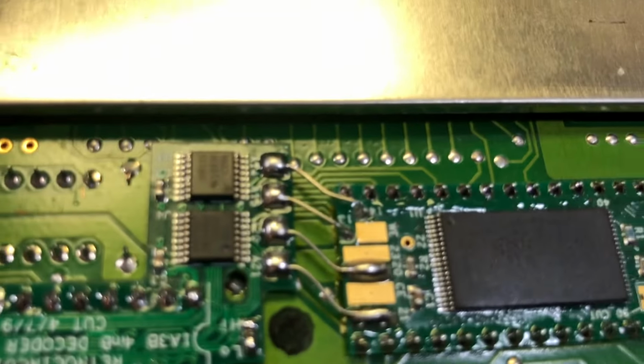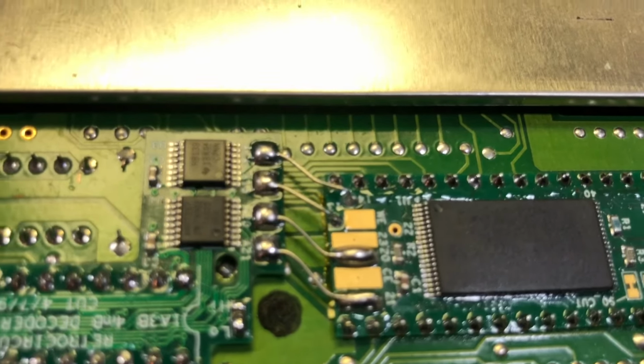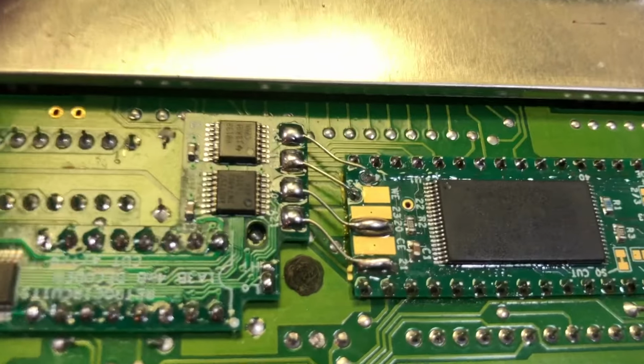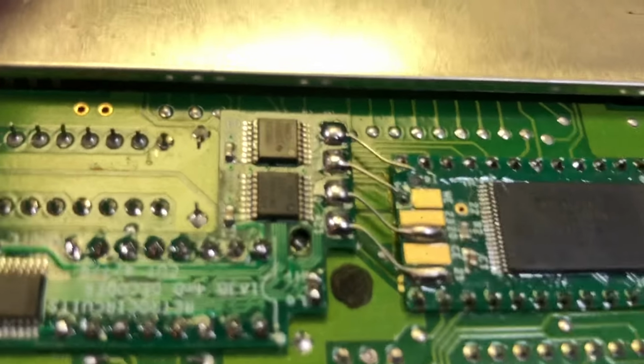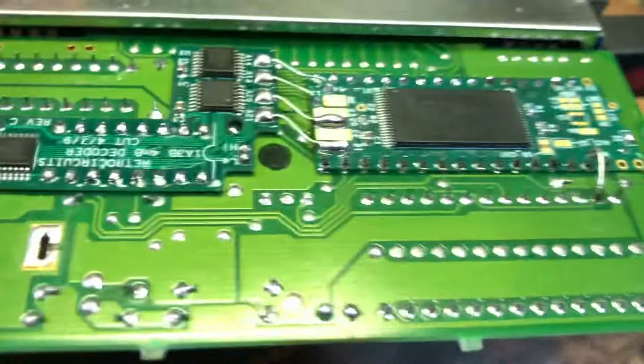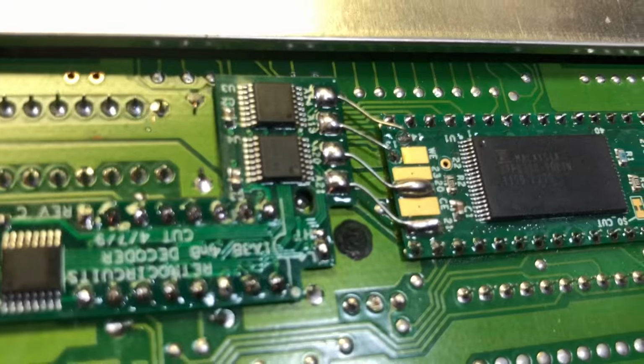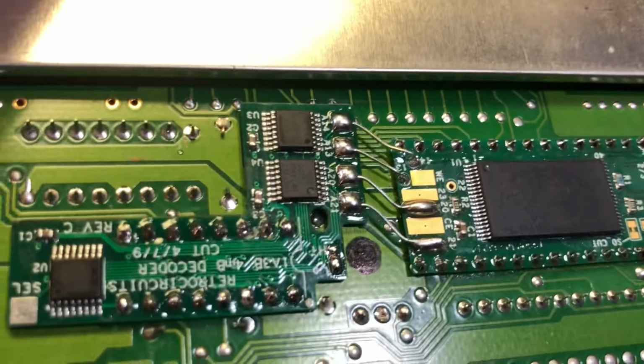So anyways, those lines 13 and 14, those address lines, those are only for high map, by the way. Low map, it doesn't need that at all. So I suppose if you were to just do low map, then you wouldn't need to put those two little jumper lines. And then of course, if you're just doing a 2 megabyte game, then you wouldn't need the A21 either. Just the one A20. So there's that.